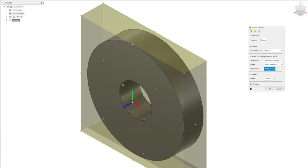And that's particularly useful on items that have very small holes, because plasma just doesn't cut very small holes that well. So we can pulse the plasma torch for a very small length of time, which will not cut all the way through, it'll just cut a little crater in the top, but it'll be accurately located. We can use that as a center punch mark. The way that we do this spot marking is that we must use a drilling operation. Plasma paths are generated on the edges of components, but we actually need to move our torch to the center, so a drilling operation is appropriate here.